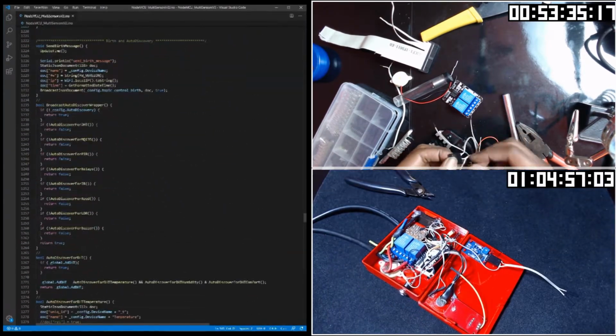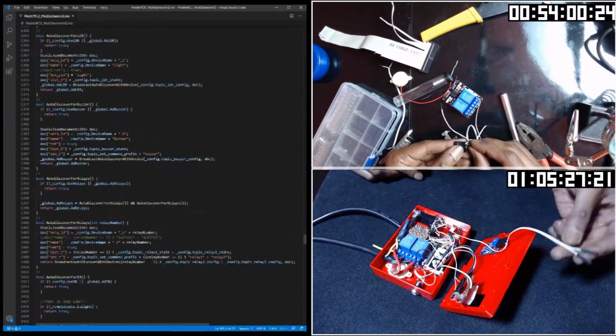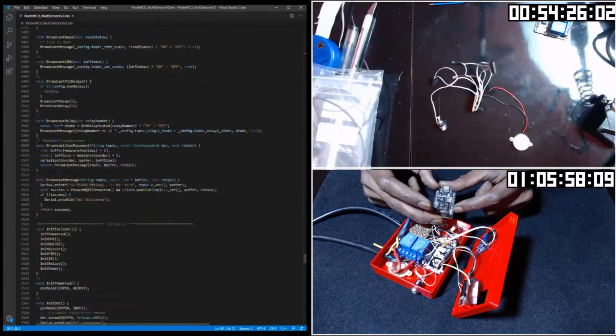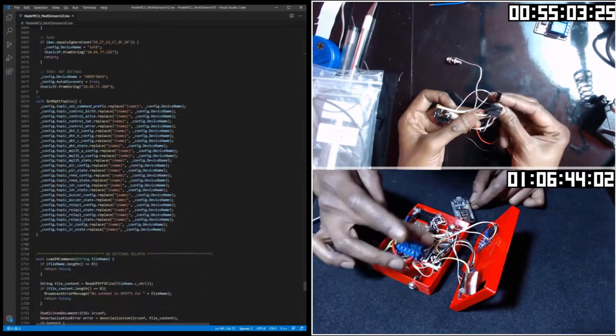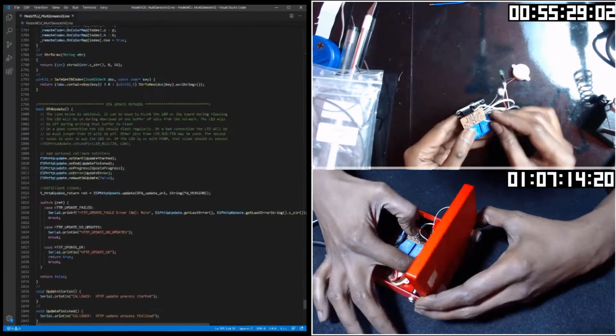To make matters worse, these relays can light up indicating it's on, but the coil itself wouldn't get energized and switch on. You will know this as the relay has an audible sound when it switches on or off. With a simple transistor driver, I know it will have enough current.